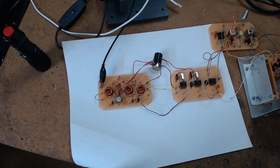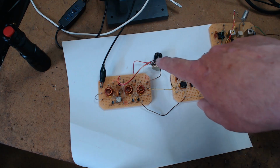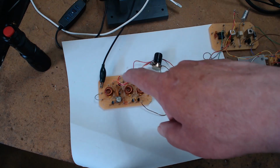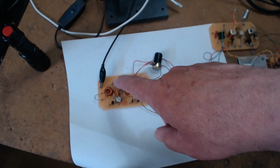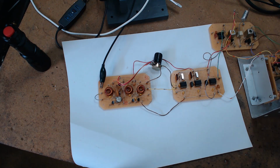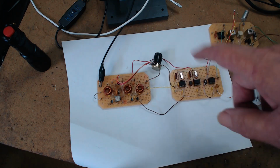And one thing I noticed on this, which is really amazing, you leave the local oscillator, the digital display, at 3 megacycles, and you tune this front end between 3 and 8 megacycles, and at 6, double the frequencies will come through, because the oscillator in the radio at 3 is also creating a second output, a multiple or a harmonic at 6. So if you detune the front end, when you're set at 3 megacycles, you can get a station at 6 something to come through.